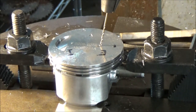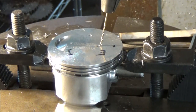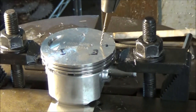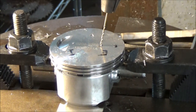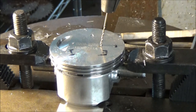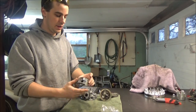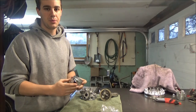What I have to do is just set them both up on the x-axis so they are directly in line, so when I move this left to right it's still centered on both holes. I'm just kind of eyeballing it — I think I'm getting probably within like five thousandths. That's why it's on the rotary table, so if one hole is behind or in front of the other, I can just rotate a little bit and move my x and y-axis to get them where I need to be. The piston's looking pretty good — just took it out of the mill and I'm pretty happy with the results.